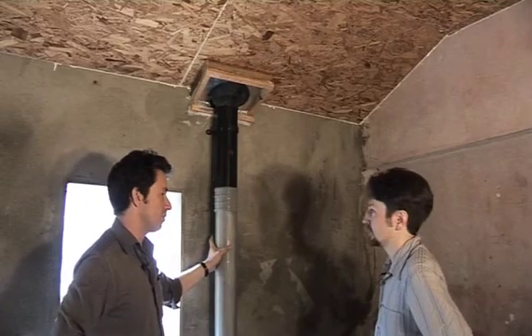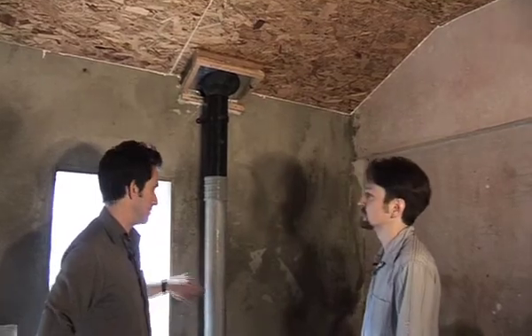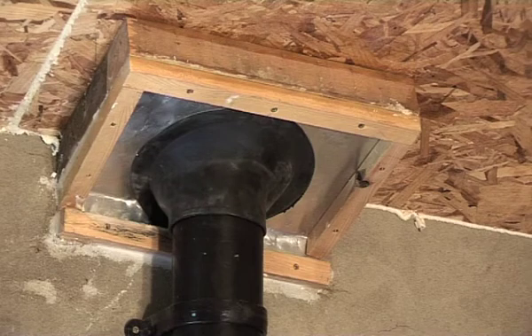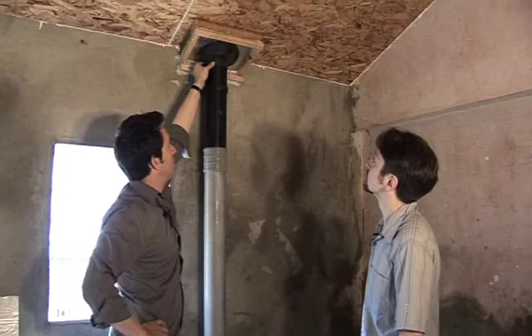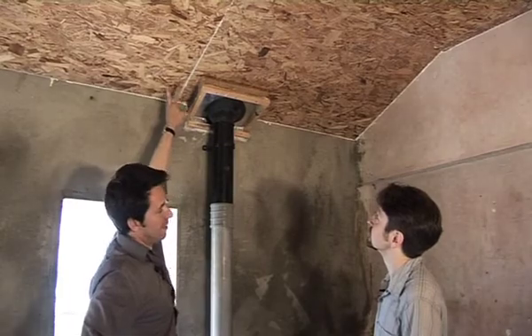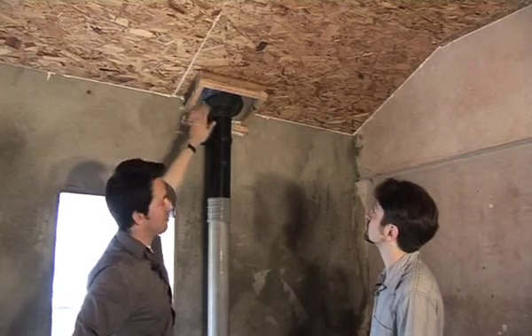This pipe is the main soil pipe. We've moved that inside the building to make interfaces on the outside easier, because the other side of this wall has external insulation. We've taken the vent pipe up into the roof and it extends around the rafters and up through an old chimney stack. Taking circular pipes through simple planes is always a tricky air-tightness issue, so we've used a proprietary grommet and plate at this point, which has then been sealed into the OSB with battens and a hefty amount of silicone squeezed together on mechanical fixings.